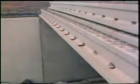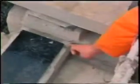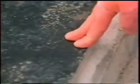The concrete beams used in many big civil engineering projects also expand and contract with changing temperature. Gaps have to be left to allow for this. There's going to be a road surface laid on top of these beams, part of a big new motorway interchange above the railway. But you can't leave open gaps — they'd fill up with debris. So the gaps are filled with flexible plastic material. And the beams are laid on strips of flexible plastic which will give as they move because of expansion, contraction, or traffic vibration.